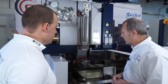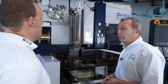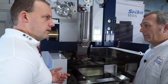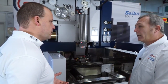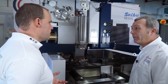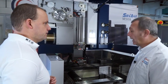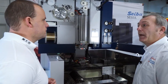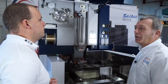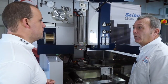What are the diameters of wire? This particular diameter is 0.25 — you can go from anything from 0.05 up to 0.35. For viewers who don't know much about wire EDM, why would you use a different thickness of wire? Usually for thicker materials you'd use bigger, thicker wire. You might also go for a very small wire if you need to do fine work with small slots or really small radii. And why would the wire break? Usually it's because there's not enough flushing or too much power going through the wire. The control works on a slider basis, so a novice user can be adjusting the power settings without really needing to know the ins and outs of what all the power settings do.